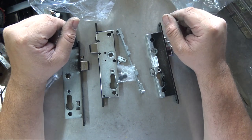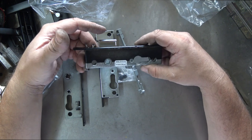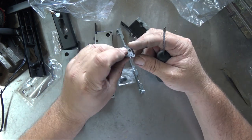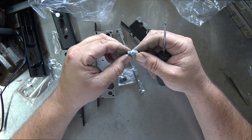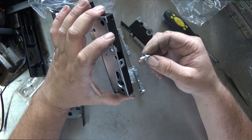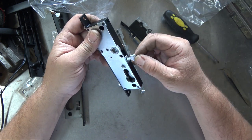So they've made this lock compatible for the MK2 and the Austral Elegance. One thing with the Austral Elegance is it does come with a special adjustable pole kit, and for that you need to knock out a little rivet. On this Carbine lock you can't knock that rivet out, which is a little bit disappointing. If you wanted to use the adjustable poles you'd actually have to re-drill this hole - they just need to make a special part for that. We do sell a number of those kits because the rods can be adjusted, allowing you to fit it in place of whatever screen lock you want.